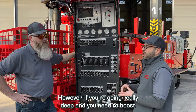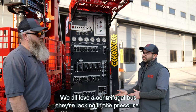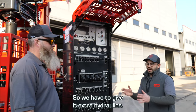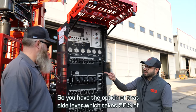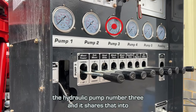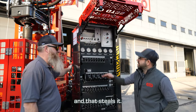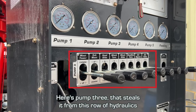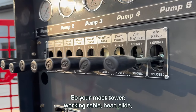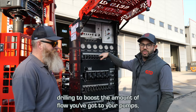However, if you're going really deep and you need to boost that centrifugal — there are advantages to each pump, we all love a centrifugal but they're lacking in pressure, so the only way you get the pressure and flow is by rotating them faster, which requires extra hydraulics. You have the option of a side lever which takes 50% of hydraulic pump number three and shares that into hydraulic pump level one, boosting hydraulic flow and pressure. That steals it from pump three's row of hydraulics — controls you're not using whilst drilling, like mast, tower, working table, head slide, winch slide — so it utilizes something unused whilst drilling to boost flow to your pumps.